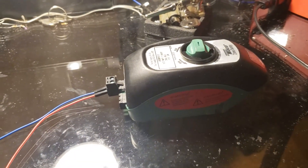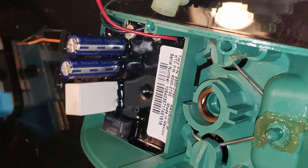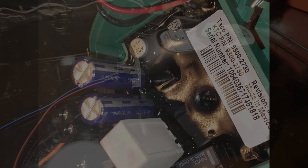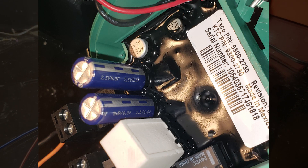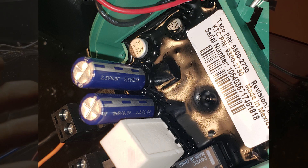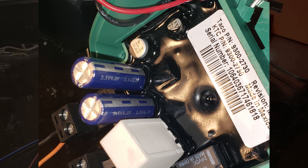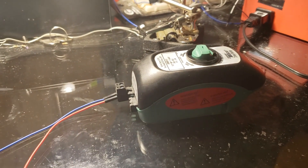I did some thinking and I'm going to show some pictures on screen because I took a picture of the guts, but they solidified the electronics so I can't get to the bare circuit board. I can see some high microfarad capacitors — they're low voltage, real tall capacitors. They charge up to drive the motor, and then when you take the power away, it's the stored energy in those big high microfarad capacitors that powers the device to close the valve. It's not spring-close, it's power-close.